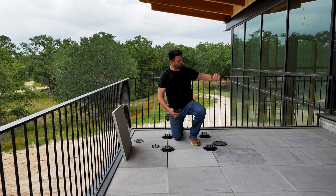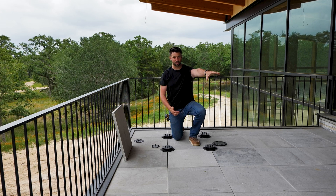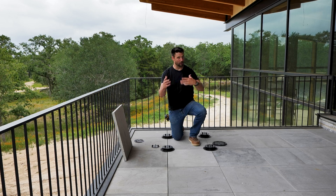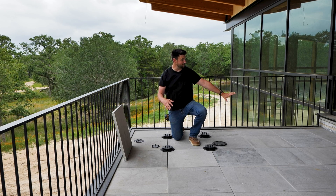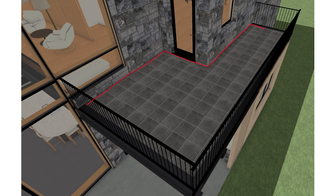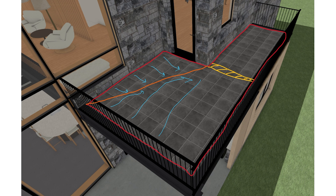In this area here, we couldn't just run the roof back towards the door, so we actually had our tile setter — he's used to making shower pans — come in and make basically a full shower pan out of this, sloped from that wall down to me this way, and then we're sloping back towards you, so it makes a nice little valley that channels right here into the gutter between us, and then your side just comes straight to this gutter in the middle.